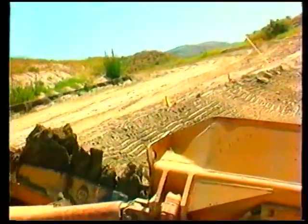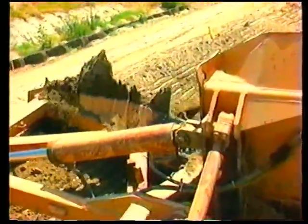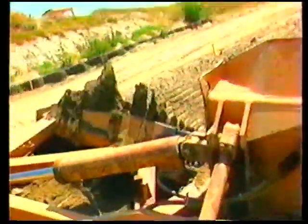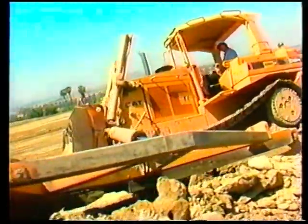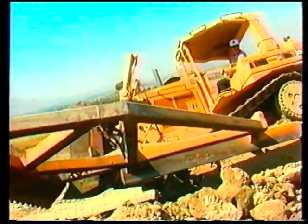Rough in the slope to within 2/10 of grade using the dozer blade. Keep the left side of the dozer blade about 1 foot below the top of the slope to keep from undercutting the top. Continue this to the end of the slope.